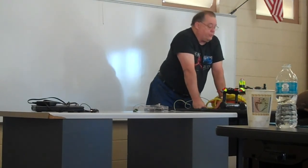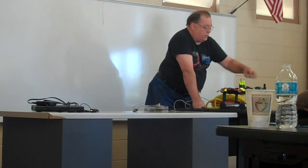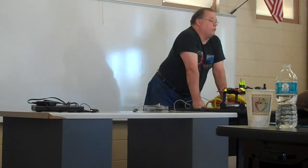Avoid the zip ties throughout the entire assembly. And I only have two here that will be enclosed on the electrical board in order to stress relieve the tether right at the board itself, because those joints have a tendency to break when you flex them.